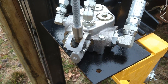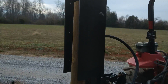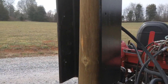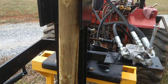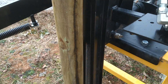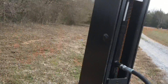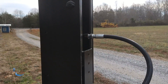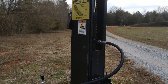The valve has this safety mechanism. Right now it is in the up position — the ram is in the up position. Hard to see on this cloudy day, but there's a big heavy piece of channel here; I'd say it's like three-eighths or half-inch I-beam. It's a big heavy piece, and it's got springs also alongside the post. There's a hydraulic cylinder — it's very long, a very long travel — and it lifts up the big heavy ram, and then when you actuate the valve it falls down on the post like that.